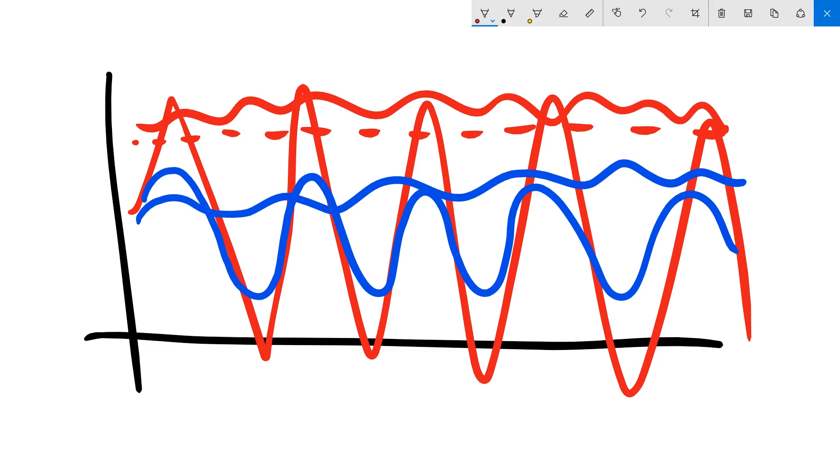So I think there is a place for a TVS diode in our copters, and that place is protecting equipment from transients — protecting equipment from overvoltage situations. But I don't think you can make the argument that you should use just a TVS diode and no capacitors, because we're not just trying to deal with transients when we have these noise problems. I hope that was educational. Please comment if I've gotten anything horribly wrong, and I'll pin a comment to the top if anyone points out something incorrect. Happy flying.